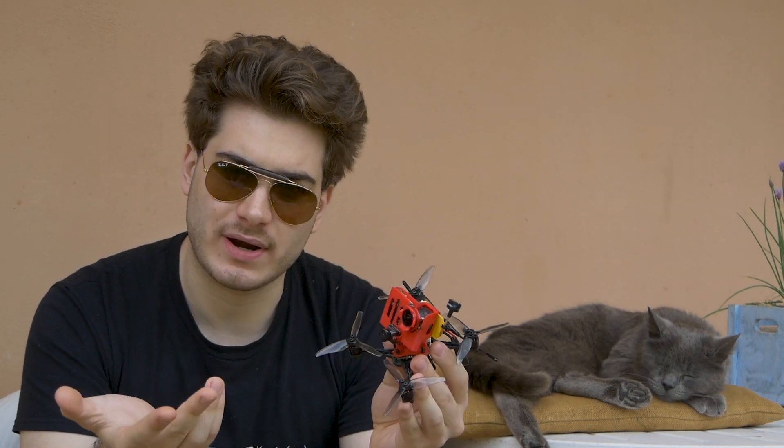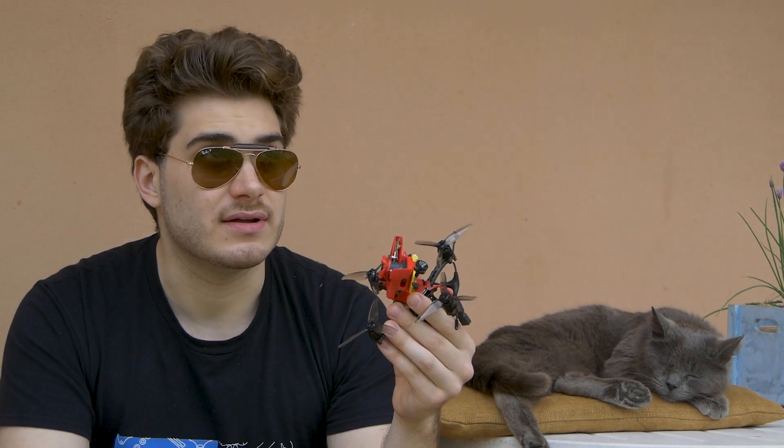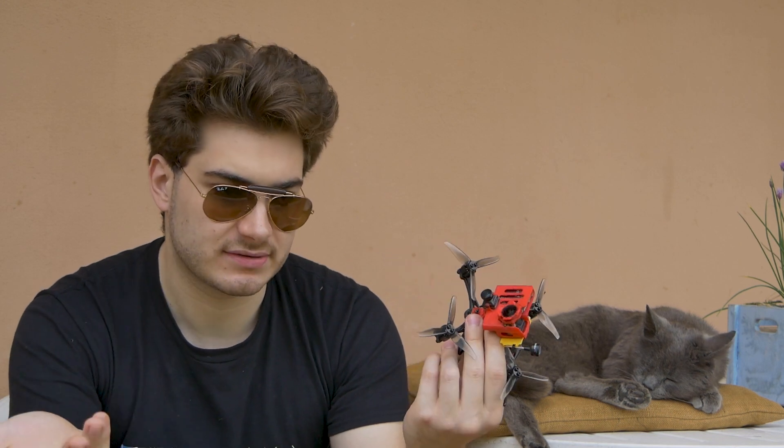This time I cut a slit for the SD card because everybody kept asking about that. Also, since drones are crashing, I made the mount thicker so it should be more protected than the other one — it's a little bit heavier but this thing can take it. There is a hook, and this thing is around 150 grams with a 4S battery and the 17-gram GoPro. It uses a metal bolt to keep the GoPro in place, and you can swap that with an M5 nylon screw to save about 10 grams.